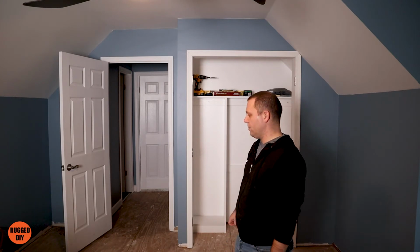In your corners, sometimes you get a corner to line up perfectly and the joint is just beautiful. And sometimes, just because the wall kind of caves in or is crooked or bumps out, you could sit there for hours trying to get the perfect cut until it perfectly aligns. But if you just have a little bit of separation, don't freak out about it, because you can fill it with plaster or caulk and everything will be just fine. So do the best that you can, and just realize that you're not the only one who can't get every piece of trim to align perfectly every time. But nobody's going to be able to see all that if you do a decent job of getting it to align as good as you can, and then filling it with plaster or caulking, depending on how wide the crack is.